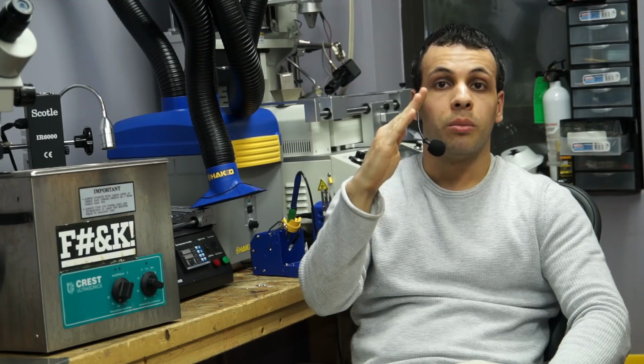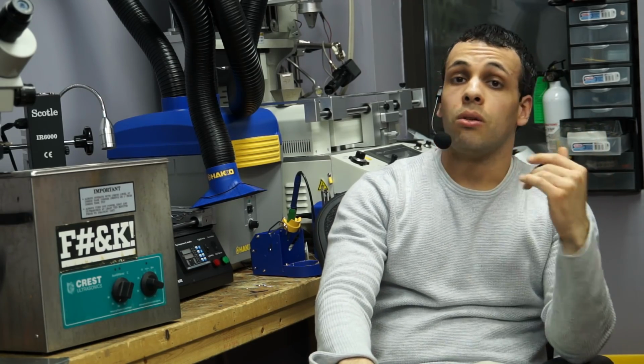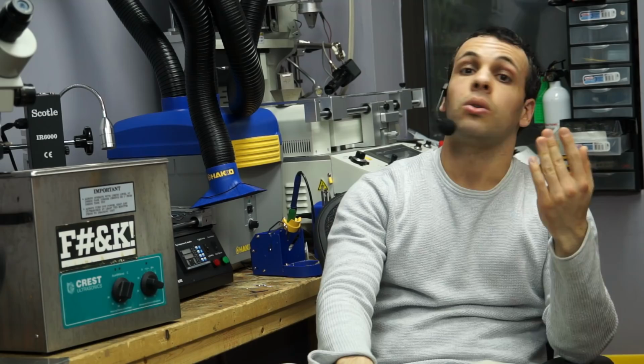How long do you heat it for? 1 minute per side. 1 minute here, 1 minute here, 1 minute here, and then I'm not as flexible as I thought. 1 minute there. What temperature? 60, 65 Celsius. Don't go higher than 60 or 65. Don't go lower than that.